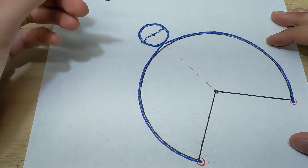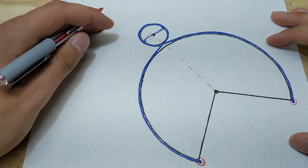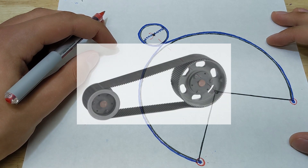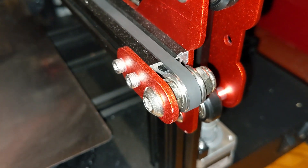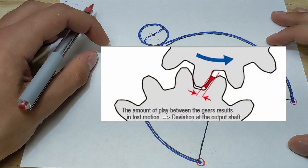From this point of origin, leaving the sheave, and this termination point on the larger pulley, this may as well just be a slip-proof belt drive. And of course this, like a properly tensioned belt drive such as those on 3D printers, has absolutely zero backlash, which is important so that I can count on the output being exactly where I want it to be.